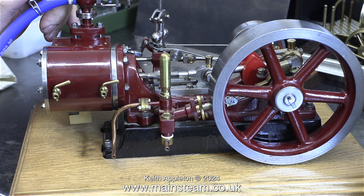Before running a miniature steam engine you must always lubricate every moving part. The most important moving part, apart from the crankshaft, is the piston in the cylinder. The top cap of the inlet valve is currently missing — it's a convenient way to oil the cylinder, but when I'm running the engine I have to keep my finger over the end of it. I'm about to run the engine so I'm going to stop speaking.